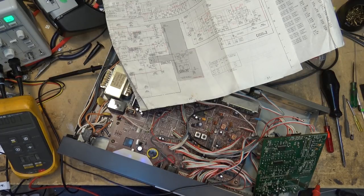I'm blaming the circuit right now because all the other radios that I play, they're received in stereo. This is the only one that's not. So I'm leaning towards something in the circuit here that's causing a problem and not a distorted signal on the transmitter, because if that was the case, I would expect that other radios would also not detect stereo, and they are. So that's where we are on this one.